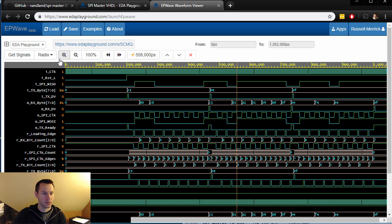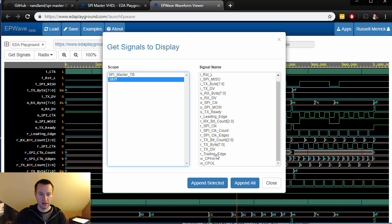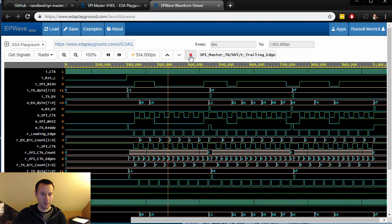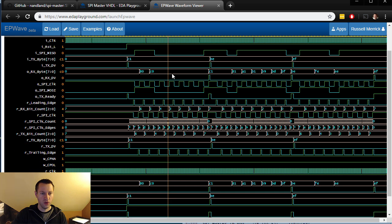If you want to add new signals to your waveform, click 'get signals' — here's your test bench, here's your unit under test — and you can append signals. You can also click on things to remove them. So let's look at the waveforms: we have C1 being sent out, there's your TX data valid pulse, here's BE, here's EF — that looks good, it's being shipped out. We have the OSPI clock toggling, the MOSI signal which looks like it's sending data, and then the TX ready signal: it's ready, we send something, it's not ready, it's ready again, we send something, and so on. This doesn't have chip select yet — we're going to add that in the next video. You can dive in and see how it's counting down and serializing things.